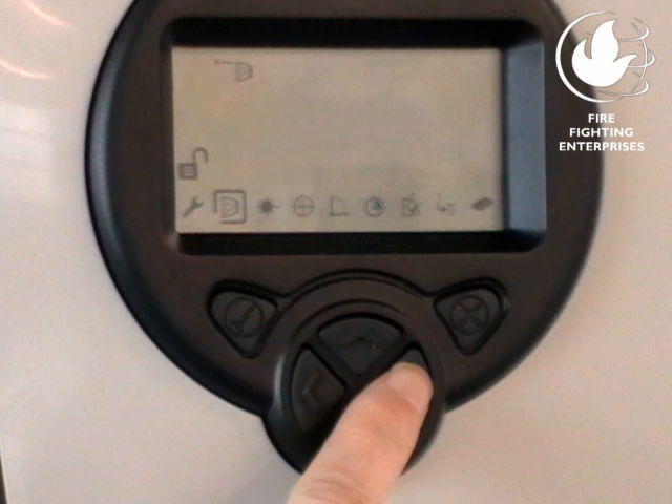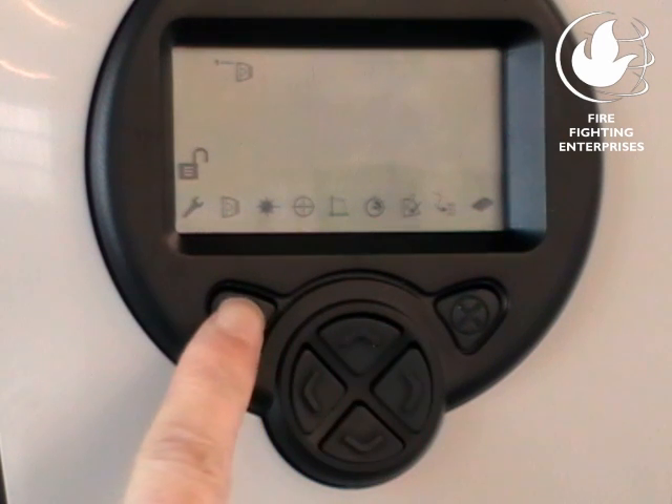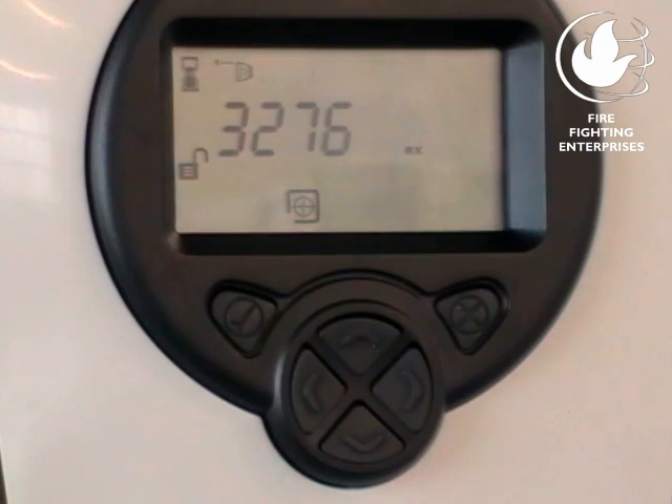You are now ready to perform automatic alignment of the chosen detector. In the alignment menu there are two options: Hand and Auto. Hand is only used by advanced users in troubleshooting, so select Auto from the alignment menu and press Check. The auto alignment will take approximately three minutes, during which detector signal strength can be viewed on the display. This procedure ensures the best alignment and detector power for the installation. If the system detects a problem, an error code is displayed on the LCD. Refer to the user guide for error codes.